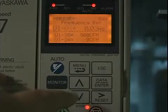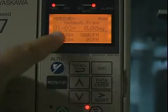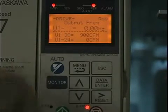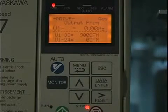We're going to get ready to run here. We really don't want to look at frequency reference — we're much more interested in output frequency. So I'll show output frequency, our PI setpoint, and our PI feedback. We'll give it a hand run command and let it run.